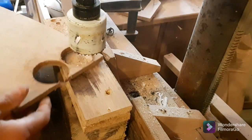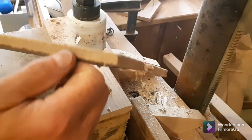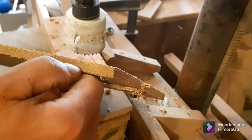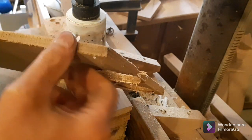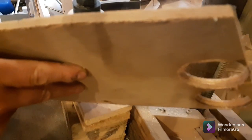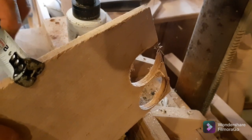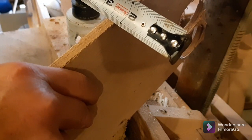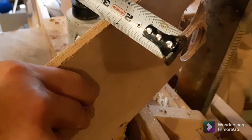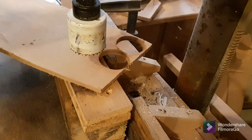Making these pulleys — you can see these are the first two blanks. I use Maranti ply. There are many plies in here: one, two, three, four, five, six, seven ply. I believe it's three-eighths at a glance — it's metric, so it'll be just shy of three-eighths. Probably a 30th of an inch shy of three-eighths. But basically, it's what's called three-eighths. Everything's gone metric.